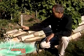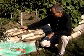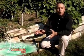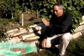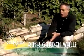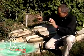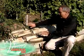What we did is we created a rock garden wall using some of the natural rocks that were right in the fields here. The important thing when you build a rock garden wall: make sure it's angled back far enough so that during freezing and thawing in the winter months, the rocks don't get forced out into the walkway. When these rocks crack and freeze, they continually fall back into the wall.